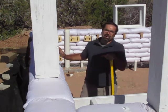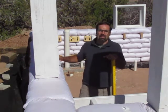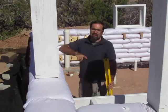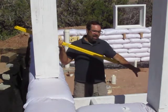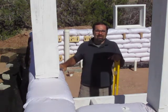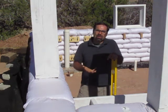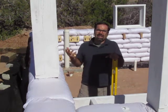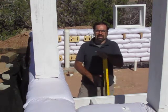I've placed all of the large windows on the southern and eastern facing sides. The reason I did that is because those are the sides of the building that get the most sun exposure. So when the sun is low in the sky in the winter, we'll have sunlight coming through at a very low angle and it's going to light up a large portion of the earthen floor. And as the family cat knows, that's like the warmest place to hang out. Because I'm using earthen materials that have a lot of mass, the earthen floor will absorb the energy from the sunlight and then slowly release it back as heat throughout the day and even into the night, keeping the house warm in the winter.